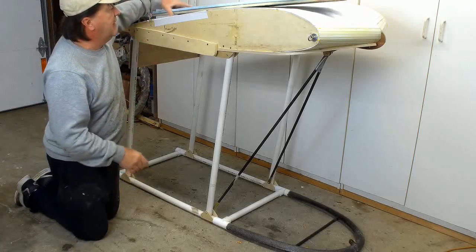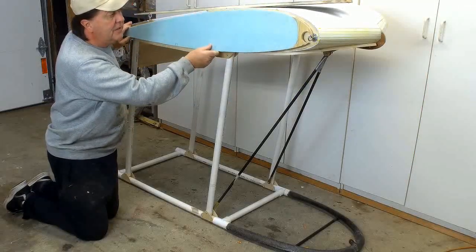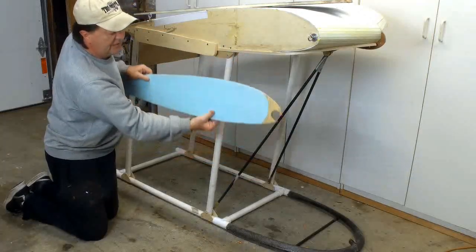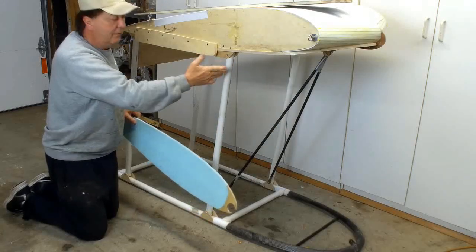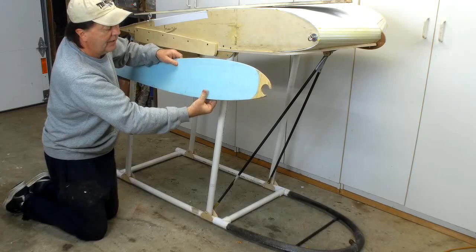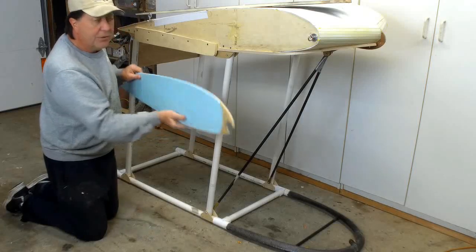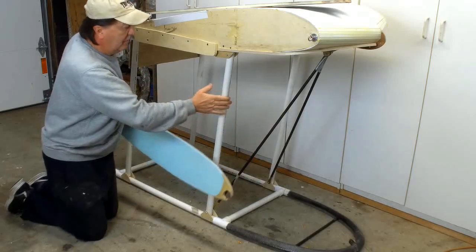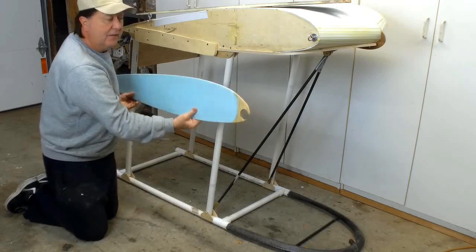So the pilot's cage is actually attached to, this is one of the actual flight hardware ribs. It'll be inside here, and there's brackets that will be attached to the rib here, extend down just like you see here, that provide an attachment point for the tubing at the top. There'll be a carbon fiber reinforcement here and a little standoff so that the brackets are the proper width. This will just be carbon fiber plate and be fine. So that the attachments here and here, and it transfers the loads of the pilot's cage up into the structure of the wing via the brackets that are here.